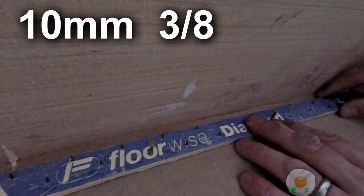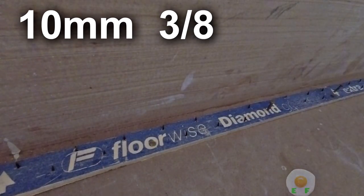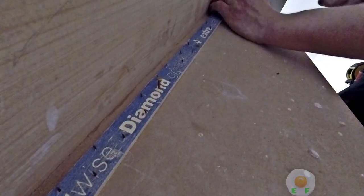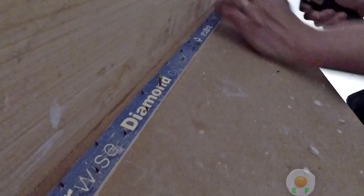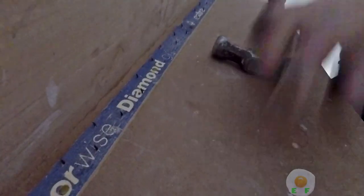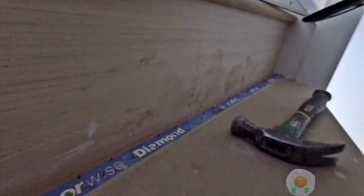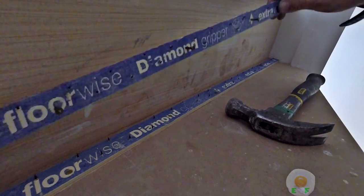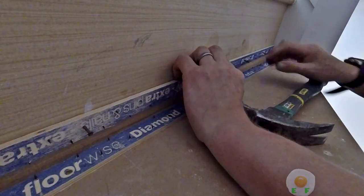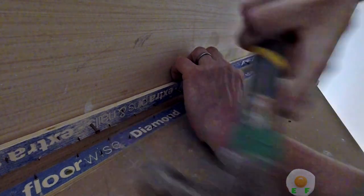This is the first step. The first step will have two pieces of cut carpet tucking in, so it only needs a 10mm gap — that's 5mm for each piece of carpet that is cut to go in. As you can see, the gripper on the tread is facing towards you so you can read it. The riser is the opposite way. This riser is made with solid wood, so it's very easy to nail.